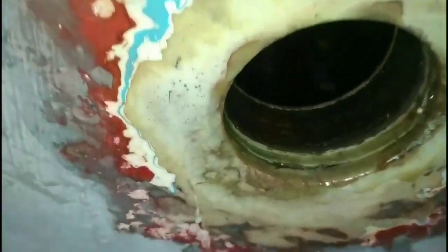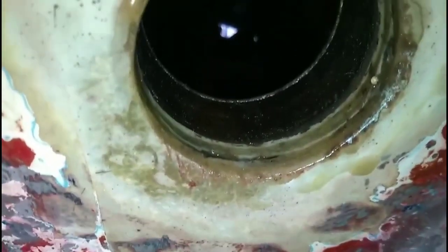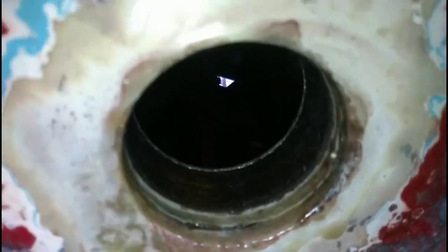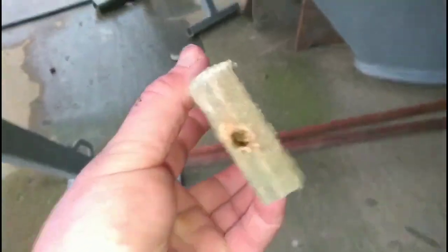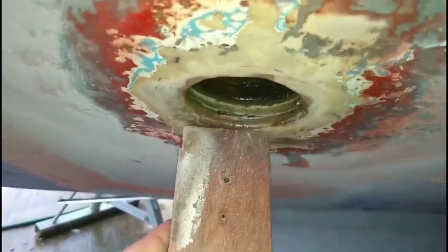What we've done is — I don't want to stick anything in on top of paint or anti-foul — so I've sanded back the entire area, made it nice and clean. I widened the hole because it was a couple of millimeters out. We've got a really snug fit now. Afterwards I sealed everything up with polyester resin. Once the hole was increased in size by about 2 or 3 millimeters, it opened up a fresh surface of wood inside where the backing plate is. I don't want that exposed in case any moisture comes in, because it will rot from the inside out. So we sealed it with resin — polyester resin, we're not laminating so that did a fine job. The outside surface: took all the old anti-foul off, back to the GRP, sealed that again. Now I'm going to clean it up with acetone and then fit the through-hole fitting.